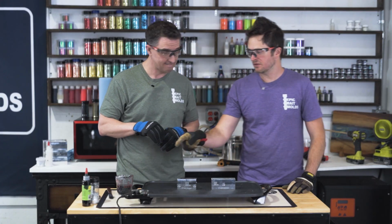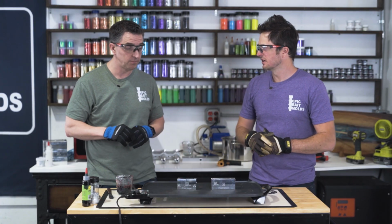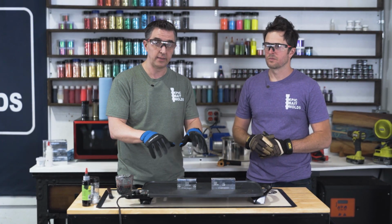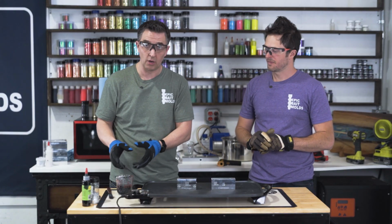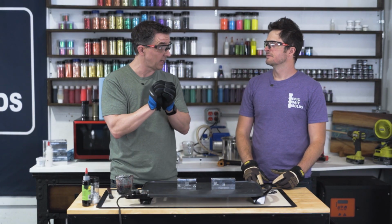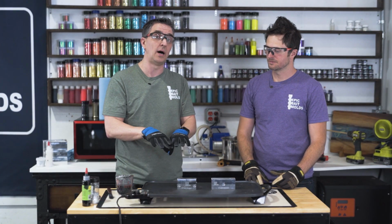And if you have this way too high, like 400, the flake will settle out, is that correct? It will, yeah. The higher the griddle is, the hotter the molds will get, the hotter the plastisol then will get, and the hotter plastisol gets, the thinner it gets, which means the flake can't suspend and all that flake will drop to the bottom. So 275, 300, let it do its thing and you should have a pretty good result.